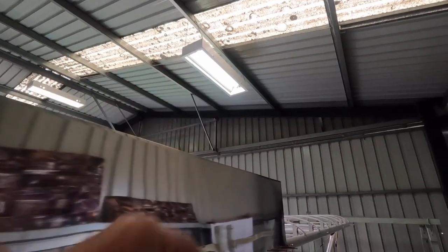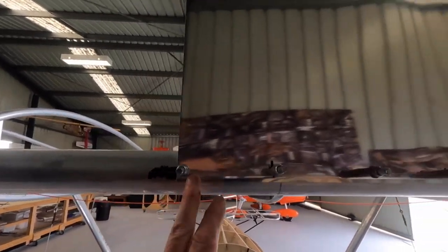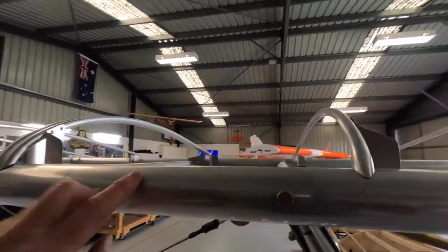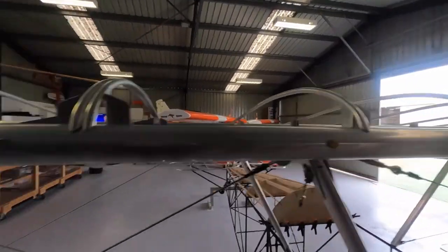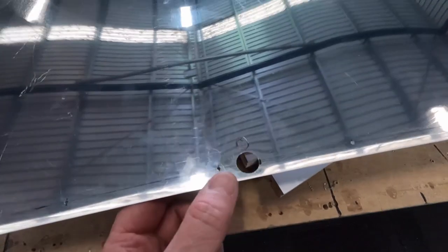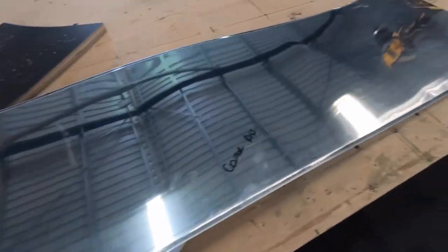You can see on this sheet the top edge is kinked nicely. The first sheet I did — the more you work it, the more it stretches, and the material ends up like a potato chip packet. I've also got a fair overlap here on my sheet — about 250mm overlap. I think I might just double it up and be done with it. Doing the center section — the sheets are four-foot sheets and the middle section is about seven feet. Pre-drilled at 100mm, nice little hole for the bolt that goes to the compression strut, and now we'll offer it up.